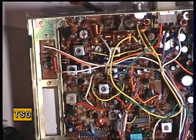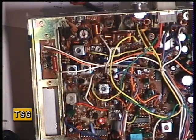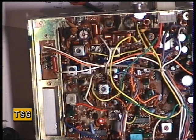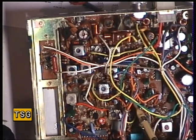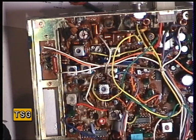So we'll set the squelch, setting threshold on the squelch control, putting the signal generator back on. My goodness it's come straight in — that's very sensitive. We'll now put the squelch to full and adjust the signal generator until that comes in. It comes in at 300 microvolts, so we're looking at a plus 30, plus 20 signal — something a bit over S9. That's absolutely ideal, really sensitive, works a treat. And if we needed to adjust it, the squelch preset is RV101, which is just down there. And that's it — works a treat.